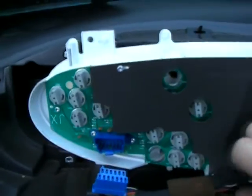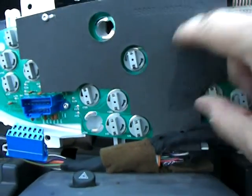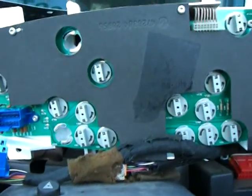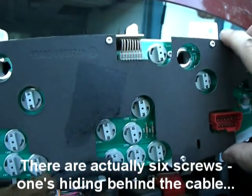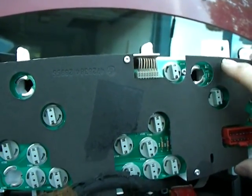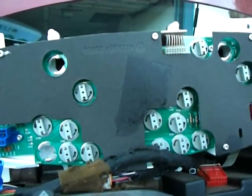You want to be careful not to scratch the front of it. So we've got this cable right here that comes in around the steering wheel — it's connected to this cardboard backing. So we want to take this cardboard backing off. I also had some foam tape up here, but it was mostly off just from heat and age. So on this model, we've got about five of these silver screws that we want to take off to get that cardboard backing off. These are Torx type screws — the ones that look like a little starburst. So you're going to need a Torx wrench to do this.